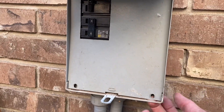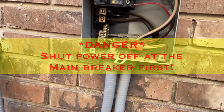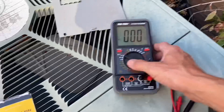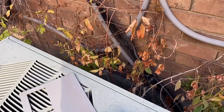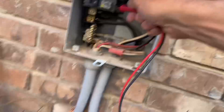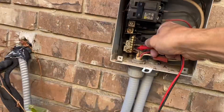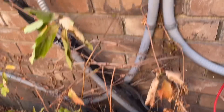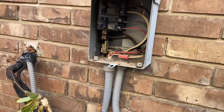Once the screws are out, go ahead and pull this panel off. You don't really want to mess with any of this while electricity is on. We're going to check for voltage — set the meter to AC, which is the wavy line, on 750 volts. I'm checking here and here — zero. Here and here — zero. Here — zero.